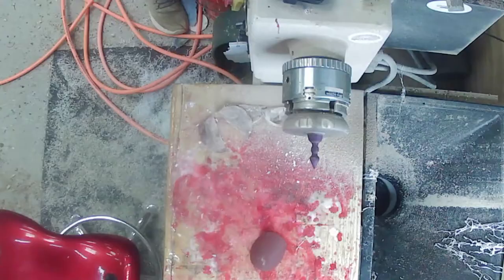Kind of missed out on the opportunity here because I forgot to hit the start record button. But what I did is this is a purple heart finial, and I applied heat to it with a heat gun. Now, if you apply too much heat, you'll burn it. But if you apply just enough heat, you'll get this nice purple color, hence purple heart.